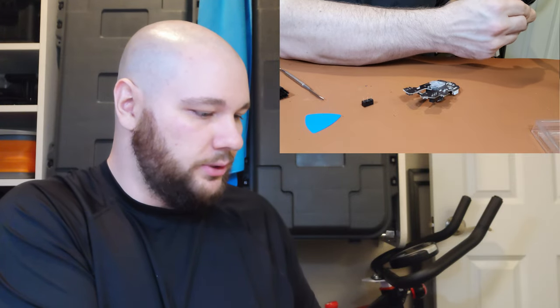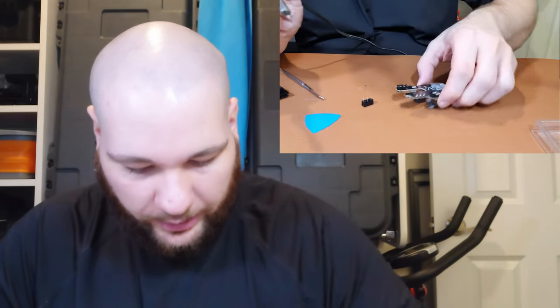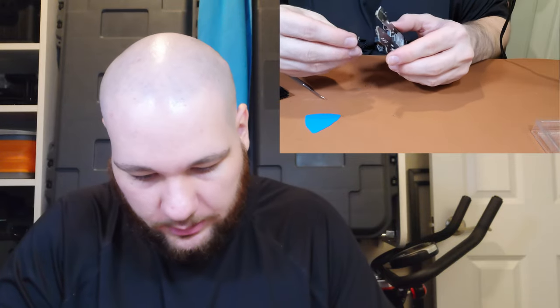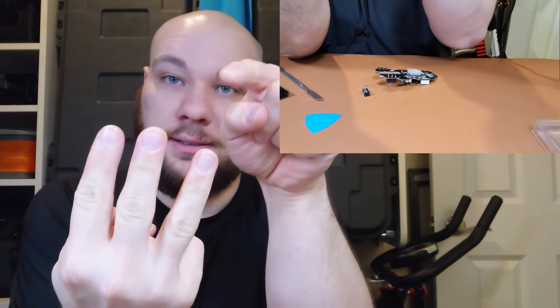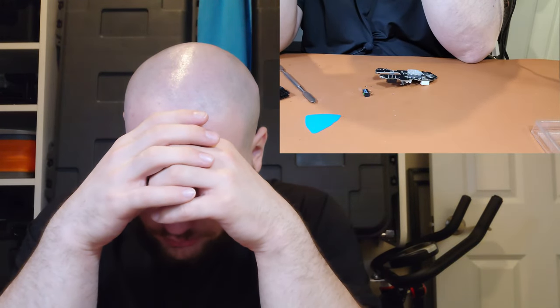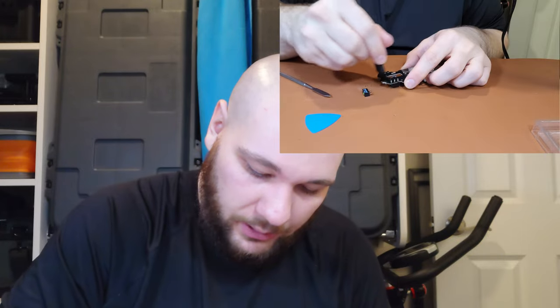Now, we have the other tip in, which is a round tip. I think the round one will work out better here. I'm going to try to get this thing back here like this. Just give it a second. Let that heat up, then I can use that to touch what's there, open up the hole a little bit, push the switch pins, all three pins, up into there, and then top them off with solder, my own solder. We're hoping. And then we'll put the whole thing back together, and we'll hope it works. And if it doesn't, oh well. I wasn't using it. I haven't been using it in a while.